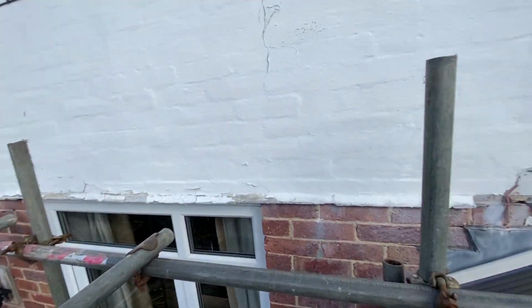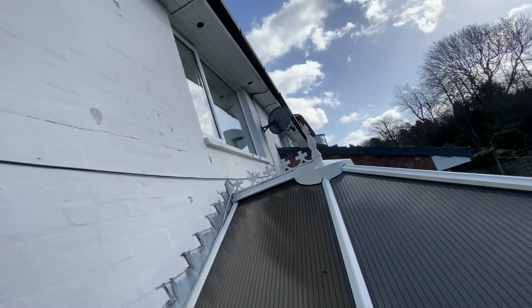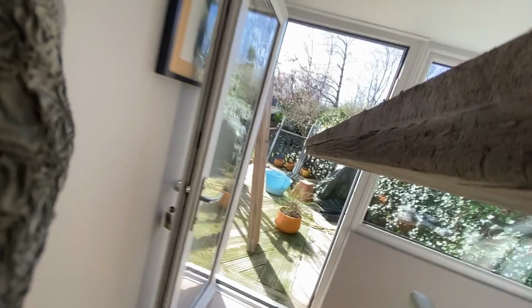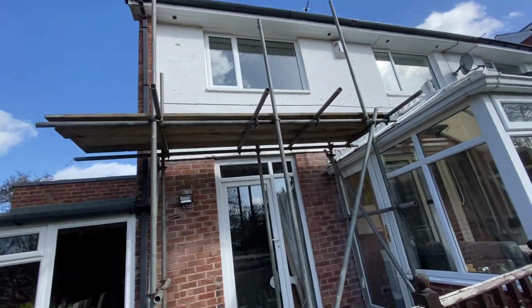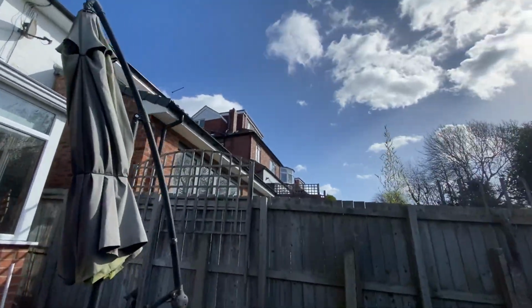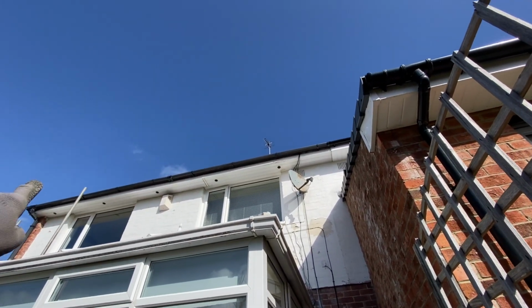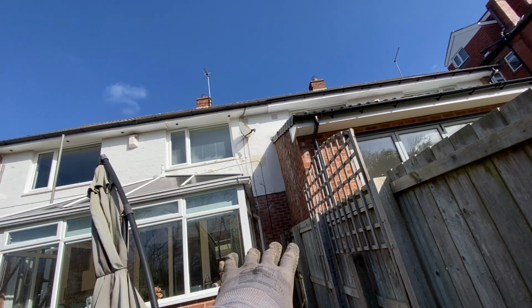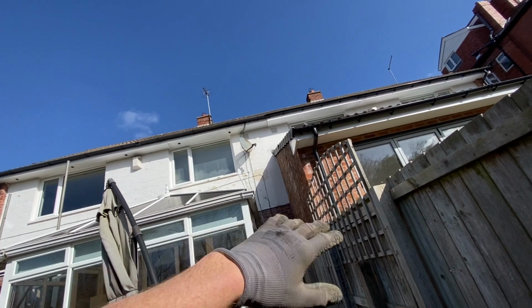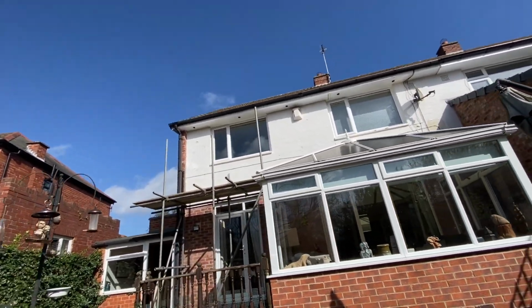Right, that's this first lift in here on this little tower bit. I need to get over the conservatory now, so I'll get some boards on this and see how I'm going to do that. Right, got some boards on there. Turn my attention to this side of the conservatory now. Had to think about it. Plan is attach a standard to that gutter like I did on the other side, throw a ledger across from there to here. That'll be the start of it anyway. Beef that side up a bit with an outside standard, a few rakers, etc. And then, because it's going to be about a 3 metre span, I'm going to have to find a way of picking it up.